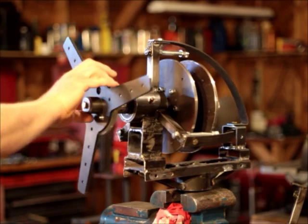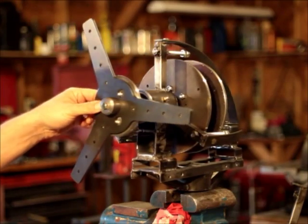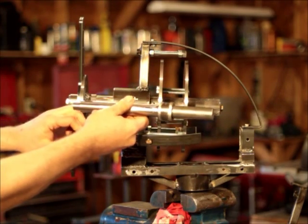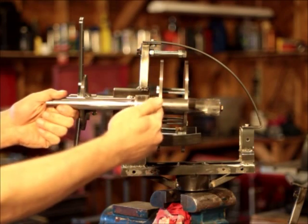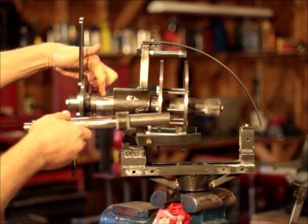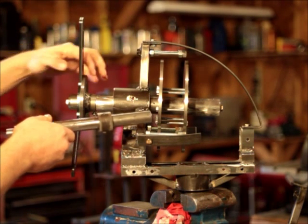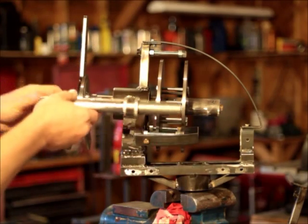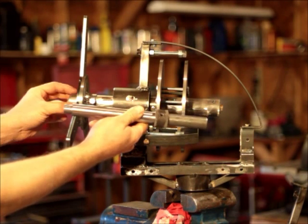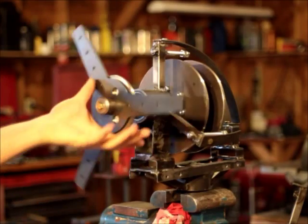There are a few unique changes on it. The shaft — here's one of the shafts, it's set in there just like that. The magnet rotor is one inch on that side and 25 millimeter all the way through to the bearings. This collar is 25 millimeter, and the back face plate is also 25 millimeter with a set screw. This one's getting a second set screw. Then I necked it down to 17 millimeter, and still has that stud for the little cone. So you can get any conventional hubs off eBay — they're all based on 17 millimeter.